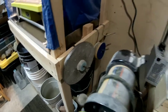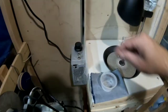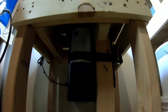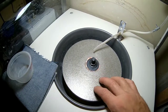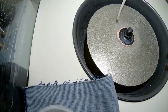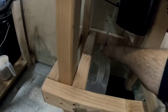These are my extra blades for my surfacer, and this is my do-it-yourself surfacer. It works with a treadmill motor — an electric treadmill motor from a Nordic Track treadmill. I can change out the discs as I need for whatever grade I need. I used an angel food cake pan for the water collector underneath, with a hole sealed shut so it can hold water and then drain out below into a bucket or a tea container.